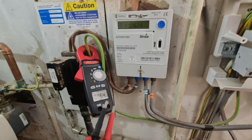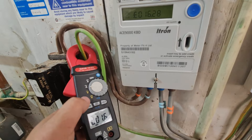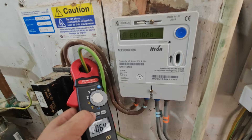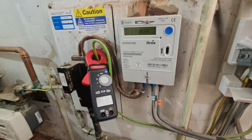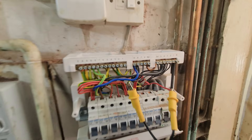I've got a point of reference set to maximum to record peak current. Currently we've got an active value of about 3 milliamps being picked up flowing down here at this present time. I'll just set that to maximum so I can see what the maximum has been while I'm interfering with these connections. If there is excess current that starts jumping up in there, I want to know about it. That's how I approach it - diverted neutral currents are worth keeping an eye on.